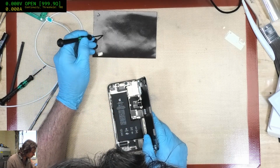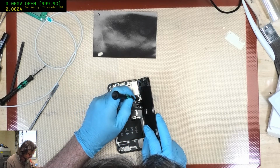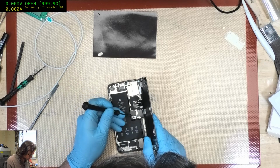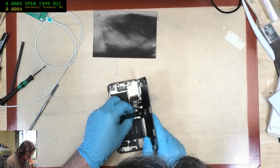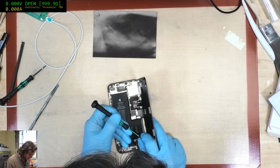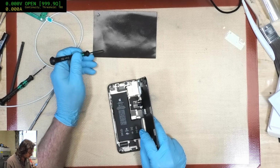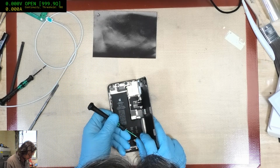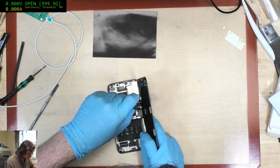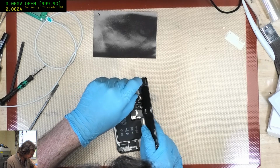But you then have to wire in that backlight, and that is not something I want to do, because it doesn't get fed via the FPC flex. It gets fed as 2 separate little wires on the back side of the LCD. If it was something that came through the FPC, it probably would be tolerable. But yeah, a separate wiring setup, it's like, yeah, no thanks. Worst case scenario, I might have to take a contrast hit and just clip the lines.